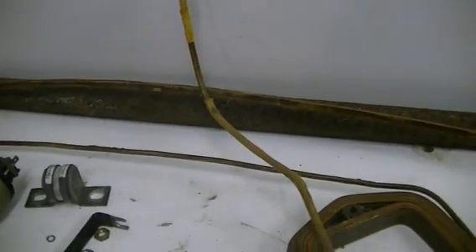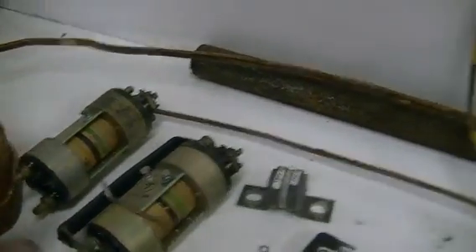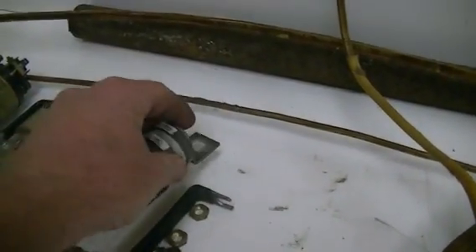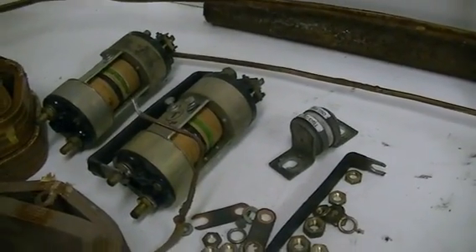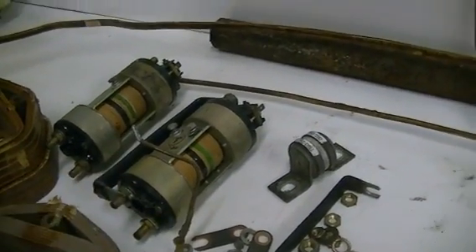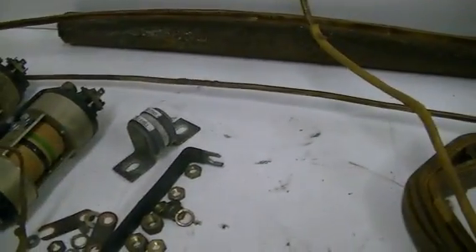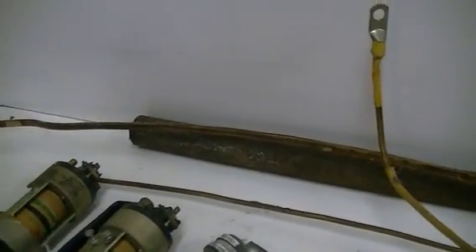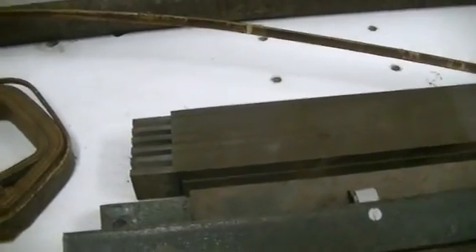So that's going to be our 48 kilowatt magnetiser — one for the large unit and one for the small unit. I do have two diodes which we'll be putting across the coil so we don't get any flyback shooting back through our contacts when they begin to open. They'll only be on for a split second, so our 48 kilowatts will be a quick pulse through the device.